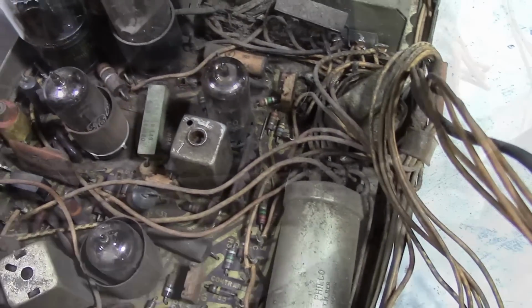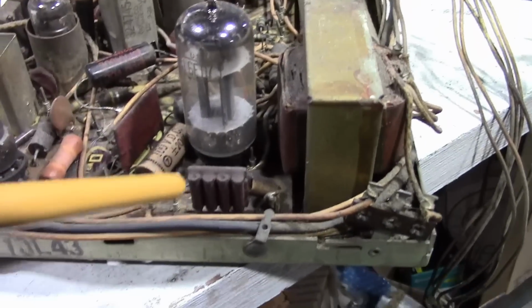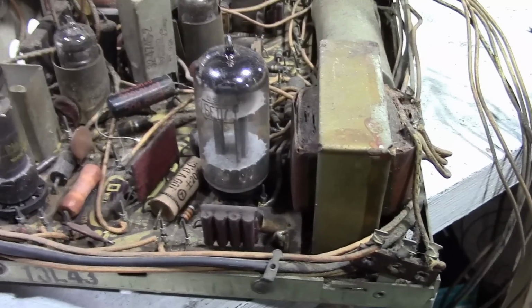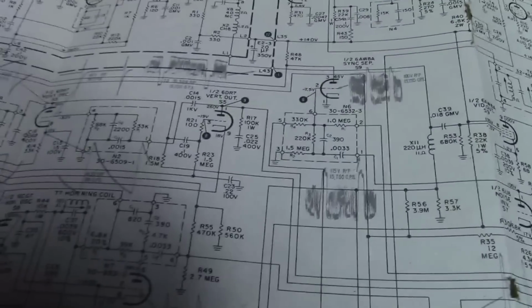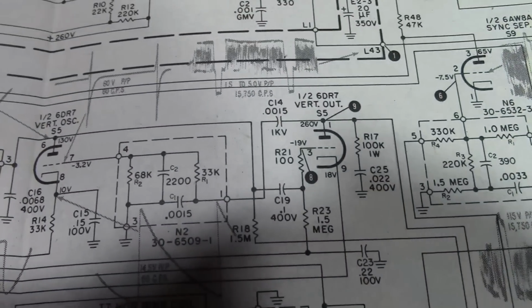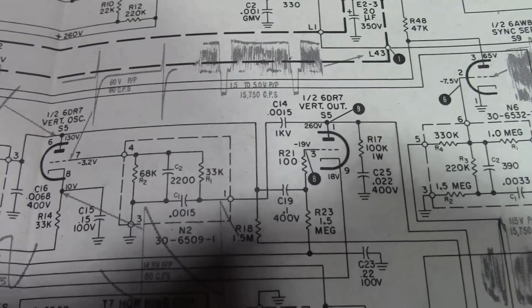And I also wanted to show you something. If you determine or decide that you do want to replace these couplates, or K-networks they're sometimes called, you can roll your own. They are shown on the schematic, like there's one inside here, or in here. So here's that one in particular. It has the 4 parts, 2 resistors, 2 capacitors. So you could certainly get those components, make a little circuit board or perf board, or even just wire them in space and replace it.